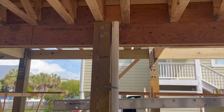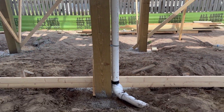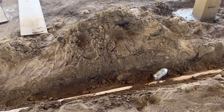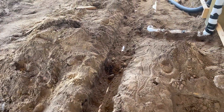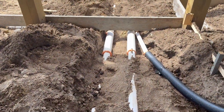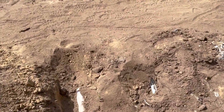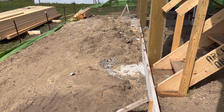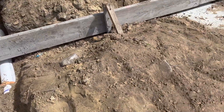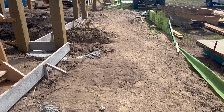All right, there's stack number three — that's going to be our workhorse. It's going to have 23 fixture units on it and three toilets on it once we get into the rough-in stage. I'll go over all that once we start the rough-in, which is going to be probably in about two to three weeks. Pipe comes out three-inch pitch, an eighth to a quarter inch per foot. Both stack number two and three come out right here, and when I come and do the sewer line, I'm going to tie those two together. I'm going to go back up this way where stack number one comes out. On the side of the house where we're at, we're going to run down — this is the side where the city sewer is — we're going to run it down to the street and tie it all in. But I'll show you a video of that when we do it.